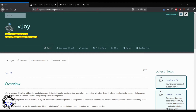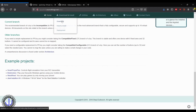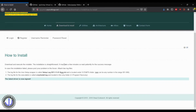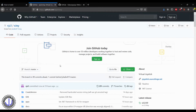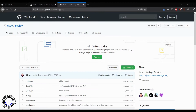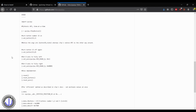VJoy is a virtual joystick emulator. It is perfect here for creating a joystick that the PC could recognize. The website has a good amount of information, including a download link. There is also a GitHub page. With the virtual joystick sorted, I needed a way to input data into it. I found a Python wrapper called PyVJoy, which I could use to input into the VJoy emulator. All the links are in the description.